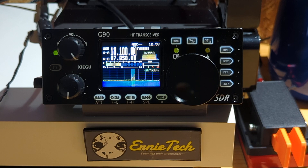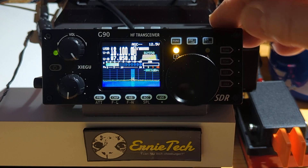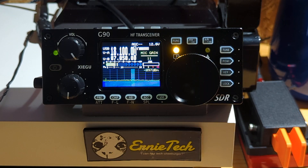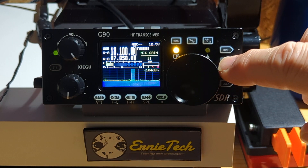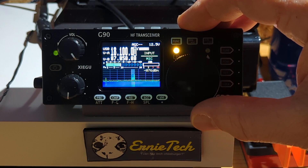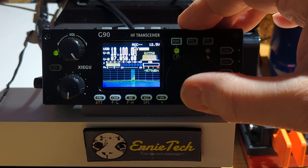The first thing you have to do is make sure that the radio is set to use the line input from the computer and not the microphone. That's where a lot of people get confused at first. To do that, it's pretty straightforward: press the FUNC button, turn on the FUNC light — I love the FUNC light — hit the PAL button once, then hit it again until you see 'input'. Use your tuning knob to go from mic to line, press the tuning knob once, and that's it.